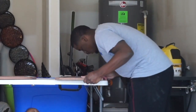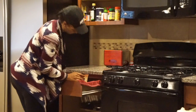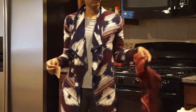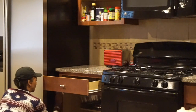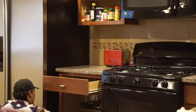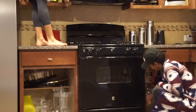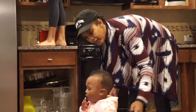We sanded both sides, front and back of each cabinet. We couldn't take everything out of the cabinets, so we put as much paper and towels down as possible so we wouldn't get dust on any food or utensils. After sanding everything down, we wiped everything off. You have to sand down every part that has wood — take away all the shininess. We're not trying to scrape the wood, just take off the shiny part, so we're barely going over it with the sandpaper.